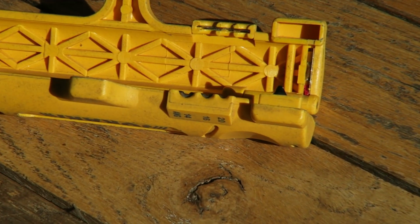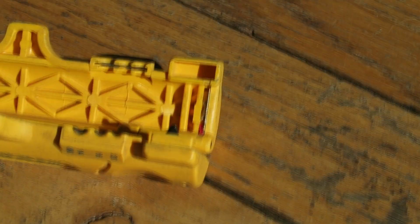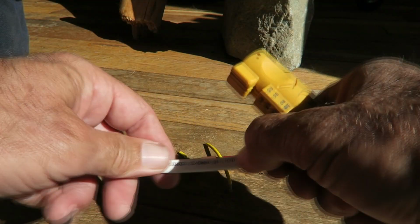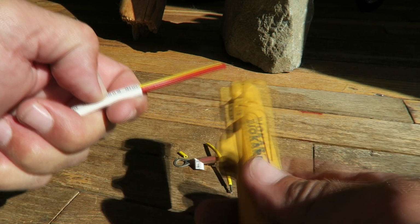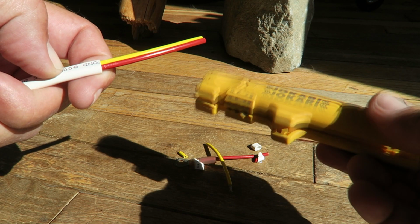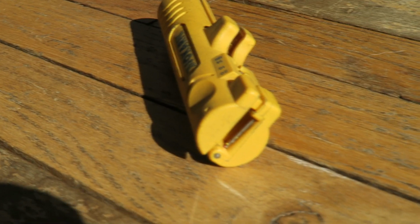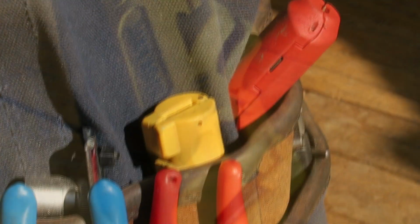It's such a simple tool, but what it does is it allows you to get up under the dash where you might have hundreds of conductors, cables coming in, and quickly turn them into these very neat stripped cables, as opposed to struggling with a knife or the other various methods that people use to strip flat cables. Can't recommend these enough. These sped up my workflow immensely, especially when working with large jobs with hundreds of loads going to panels. So you're sitting there stripping those things all day. These will make your life so much easier. So those are a fantastic tool. Can't recommend them enough.